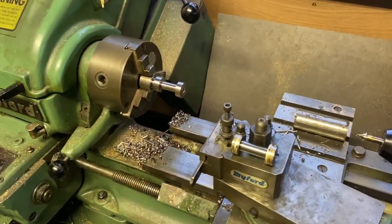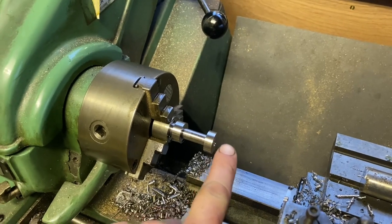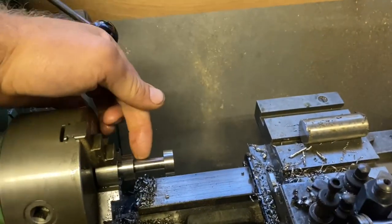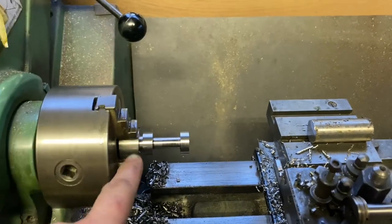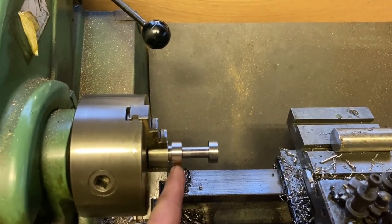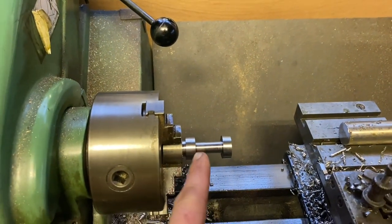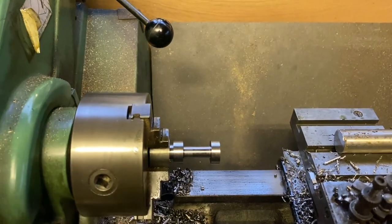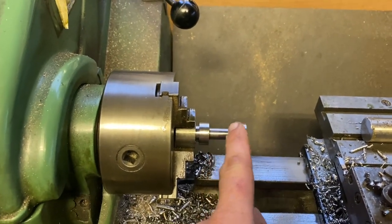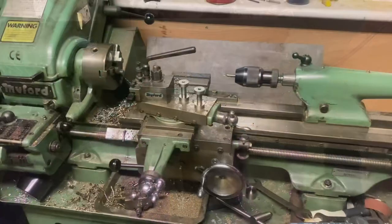I've now machined the center to the right diameter — that face is finished, though I might take a slight polishing cut to get rid of the burr. I've left it to cool and already drilled probably half to three-quarters of the way through. Next I'm going to part it to length — mark the length with the parting tool, chop it, spin it around, face it, then drill from that end. Then I can turn it between centers, clean up, take a final cut across the outside, and get the internals of the heads to the right length.